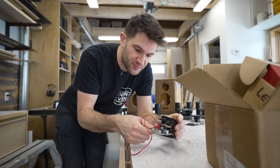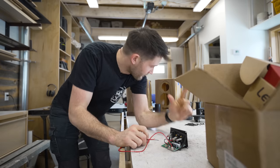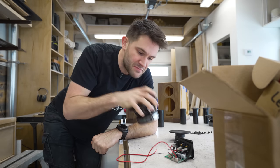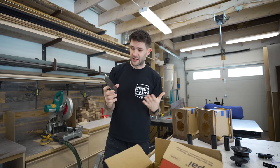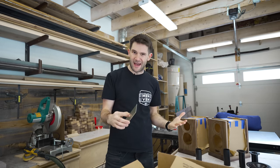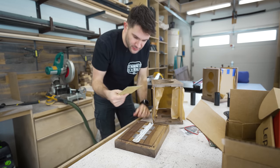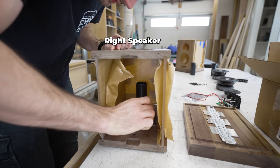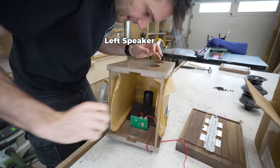When I first unboxed all these parts, I took a look at this board — two wires coming off the back, connect those to the driver, and bingo bango you're good to go. However, in these speakers we have two drivers: a tweeter for the high-end sounds and a woofer for the lows and mids, but we've only got one lead coming off the board. What we need is a crossover — a circuit that separates the mids and lows from the highs. Normally you would just mount this on the bottom of your speaker cabinet. However, I in my infinite wisdom have mounted the lights right in the perfect place to put the crossover, and I can't put the crossovers above the lights because they'll block them.